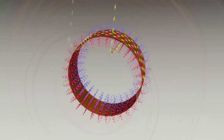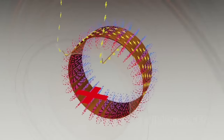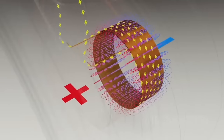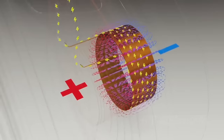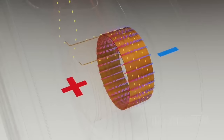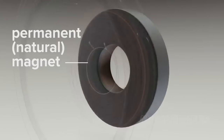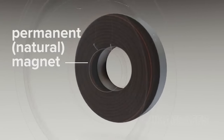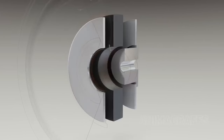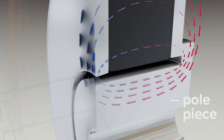When you electrify a coil with AC power, you get a magnetic field. That magnetic field works with the field from the driver's magnet, and that's what moves the cone in and out at the appropriate frequency. This creates an electromagnet. An electromagnet can act just like a permanent magnet — what's amazing about it is that its polarity and magnetic intensity can be changed just by altering the electrical signal current. It can be made stronger or weaker, or you can even reverse the polarity, causing the speaker to operate in the opposite direction. The driver's permanent magnet has top and backing plates with a pole piece in the center, which helps focus the magnet's field and guide the voice coil through the gap.